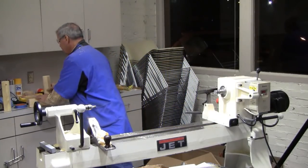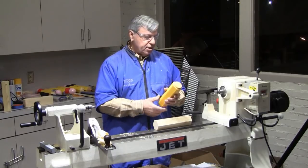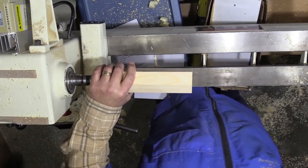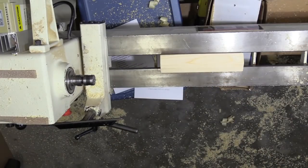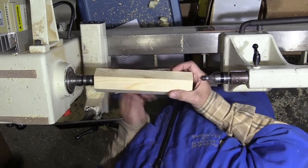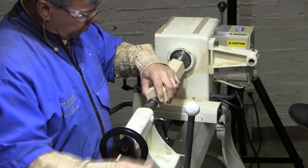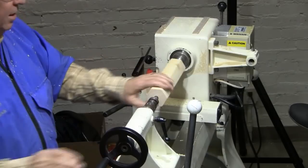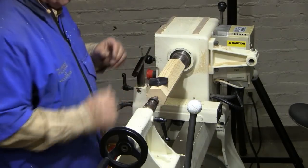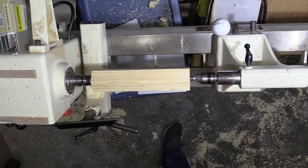The next step is to take this hexagon and hollow it out. One more thing I 3D printed that's very helpful: I have to find the center, and I want to get it really close. So I printed a hexagon shape with a hole in it. I can just put it over the end, mark the center with a pencil, and I've got the center — no measuring, no fiddling around. Just stick it on there. That comes in the kit too.